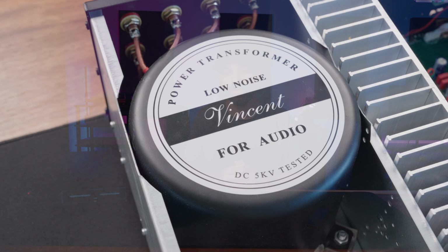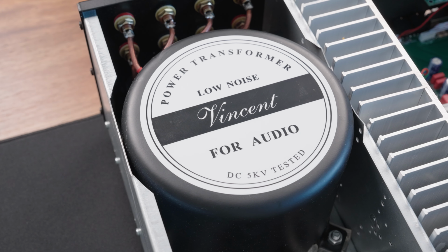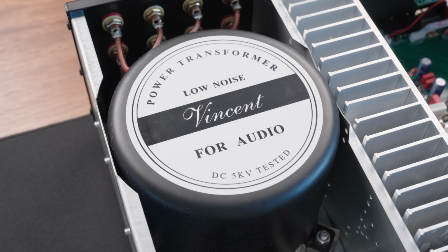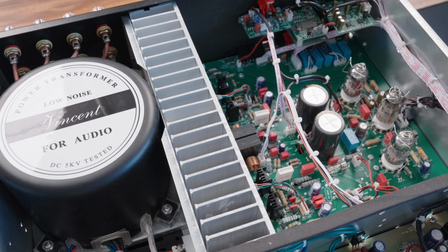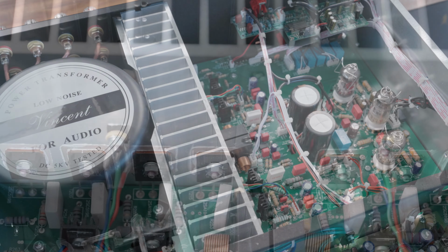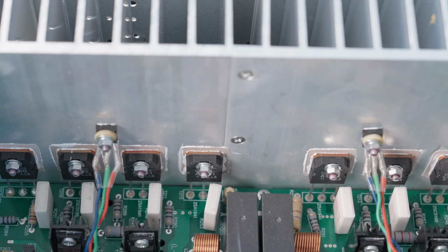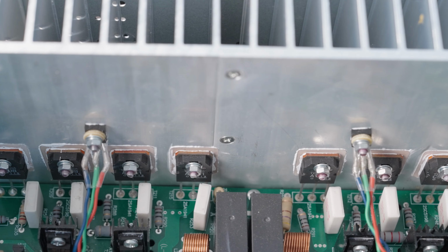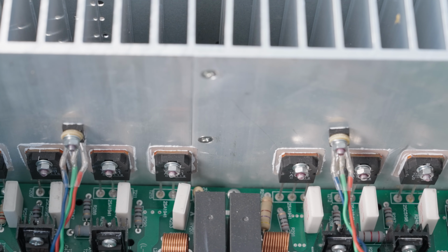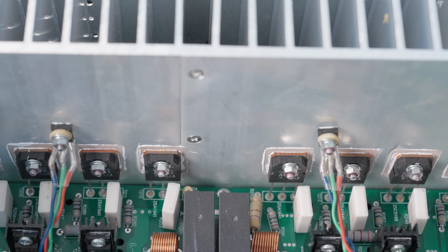Opening the chassis reveals an absolutely massive power supply on the SV-228, which is important because that's basically the foundation of any amplifier. So having a big power supply is helpful for music production and performance. To the right of that, you have a large heatsink for the output stage, which consists of 4 C5198 and 4 A1941 Toshiba transistors. It's basically the same design as the SV500 I reviewed before, but with double the amount of transistors. It's actually the same exact transistors, there's just 4 of each instead of 2 of each.